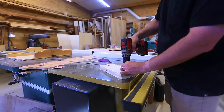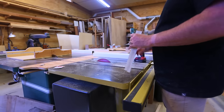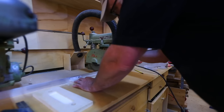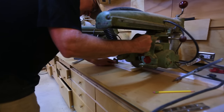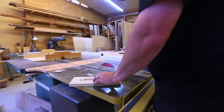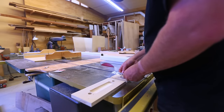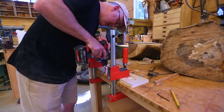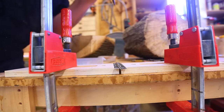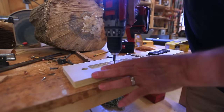I got them flush, marked one end, and added a hinge at that end. I cut a little dado to take up the space for the hinge — I had a little piece of piano hinge left over that I could use, so I attached that in the little slot of the rabbet.